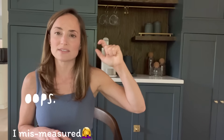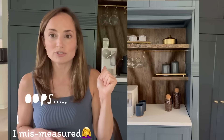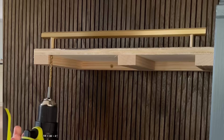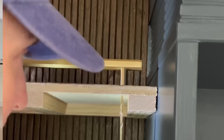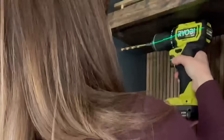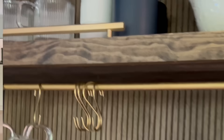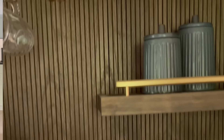I didn't account for the thickness of the shelves, so it wouldn't have worked to have the shelf go all the way across with our coffee maker. That's how I ended up with the asymmetrical shelf design. The guardrails I used asymmetrically are actually pulls from CB2 — I just love how that looks. Instead of using regular coffee hooks underneath the shelf, since the plywood is too thin to hold weight, I drilled a hole in the side of the cabinet, ran a three-foot metal rod all the way through, filled and sanded the hole, then rub-and-buffed the rod gold to match and hung the hooks on it.